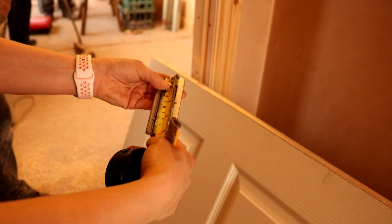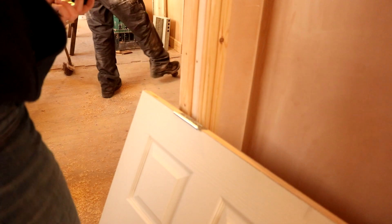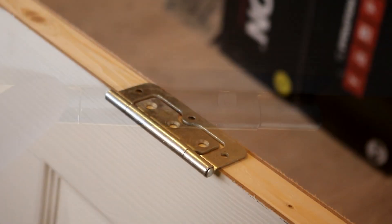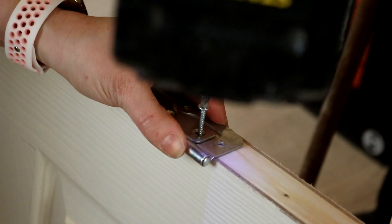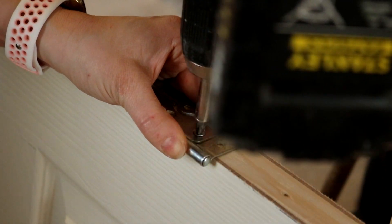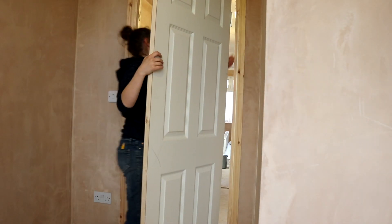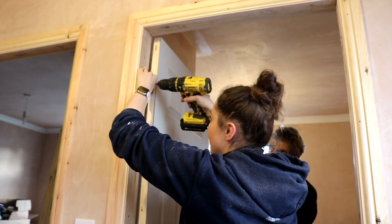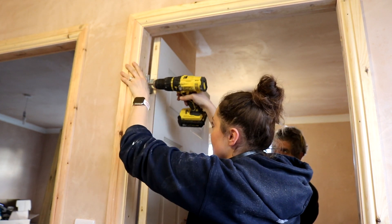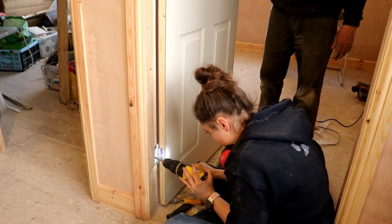Most people use three inch ones. You'll also need to determine which way your door is going to open as that determines which way you'll have your hinge. These hinges have lugs on them — protruding bits that when you position the flush hinges on the door, stop it from going any further. Once you've got those lined up with your pencil marks, it's normally recommended to pre-drill holes to avoid splitting, but I just screwed them in and had no issues. I position the door in an open position using a chisel and hammer method to press it down, pushing the hinge towards the frame until it stops. Normally I'd put a penny at the top and screw to the frame, but if you've fitted hundreds of doors you can do it by eye.